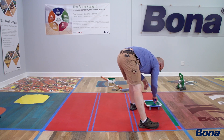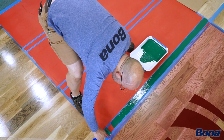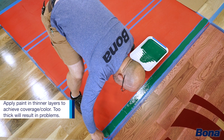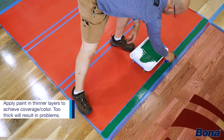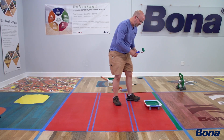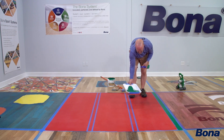On nice dark colors like this green, just a single coat — might need two, but I think one's going to probably do it here. Using the roller is a great method for those colors that you know are going to cover in one or two coats. It's definitely faster than a brush and puts down a nice even coat when you've got those darker colors.